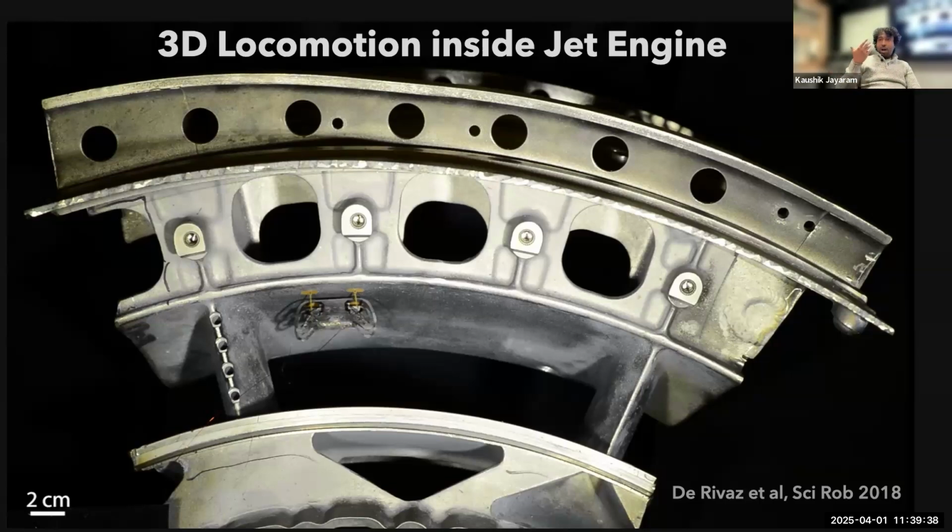It turns out that the electroadhesive force is directly proportional to the square of the voltage, and inversely proportional to the square of the thickness of the material. So it's directly proportional to the electric field squared. By making those materials thinner, we can get a lot more force out for the same voltage we apply. Is it affected by water, oil?